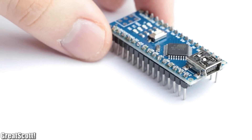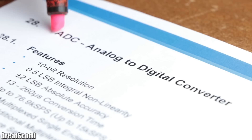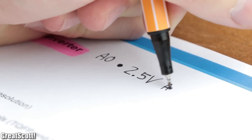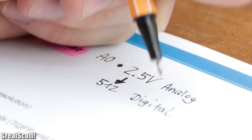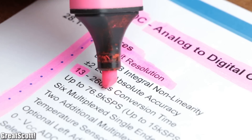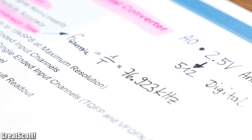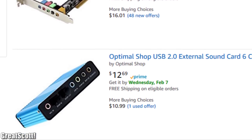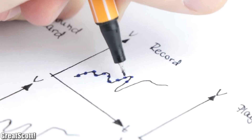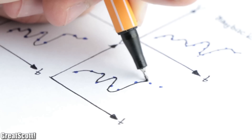When it comes to the qualifications of the ATmega328p for audio recording, we must take a closer look at its datasheet — specifically its ADC, aka analog-to-digital converter, which turns analog voltages into digital values. There are two decisive parameters: its resolution of 10 bits, and its fastest conversion time of 13 microseconds, which equals a sampling rate of around 76.9 kHz. These values are quite low compared to ADCs of modern sound cards with sampling rates of 192 kHz and 24-bit resolution. So while sound cards record tons of data points with small steps, we will be recording a more bumpy ride — but it should still work.